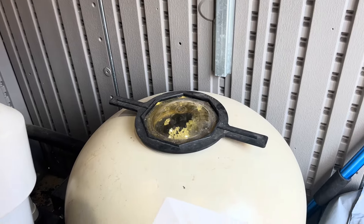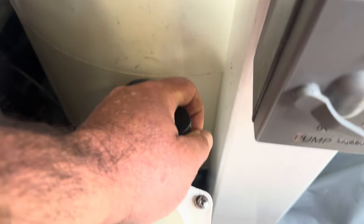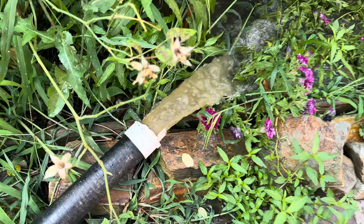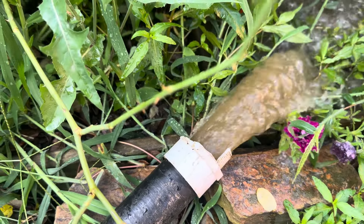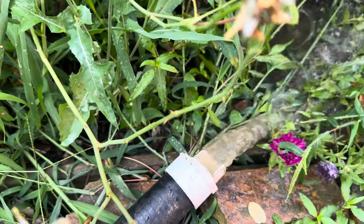After 45 seconds, you then go over to the multi-port valve head and turn it to backwash. Look at how dirty the water is that's coming out — that's all fish waste coming out now.